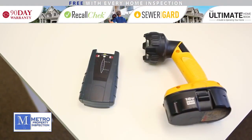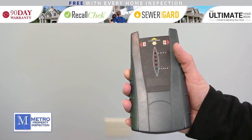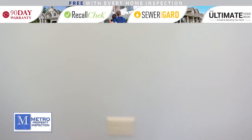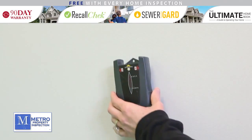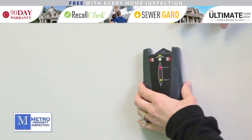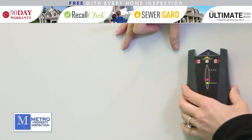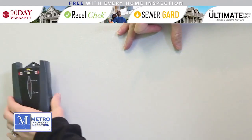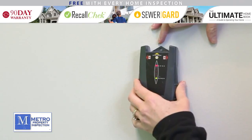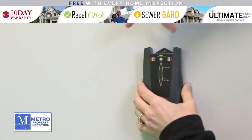A battery-operated stud finder and a flashlight. The surest way to find a stud in a wall is with a stud finder. Most stud finders have lights as well as sounds that cue when it is over a stud. First, hold it flat against the wall and press and hold the calibration button. Wait until the lights are green and there is no beeping. Slowly slide it along the wall. When it starts to beep, that's the beginning of a stud, and when the beeping stops, you've crossed over the stud. Do this a couple of times to confirm it is consistent. Mark the center of the beeps and lights to mark the location of the stud.